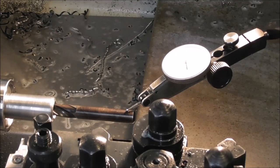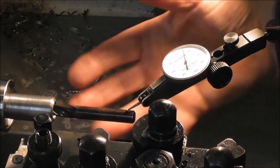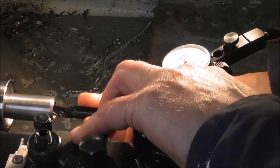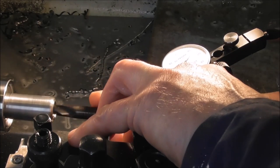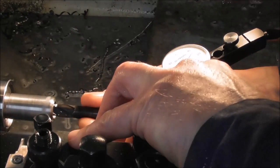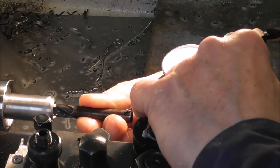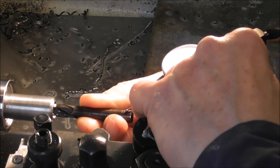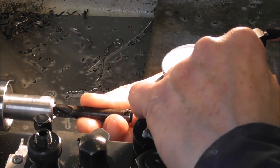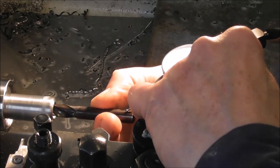It's a good idea to run the lathe and actually hold the drill — you can feel it. I've put a dial indicator on here to show you, but you can feel it. If it's running out, this will be trembling quite a lot. Just letting it run is not so good because the drill's not accurate. But if you hold it, you can see there's only about a hundredth of a millimeter — so there's only a thou or two runout off centre, which is about as good as you can get with a pilot drill through the middle. Quite often they'll be running out a long way and you don't realize it unless you do this very simple test.